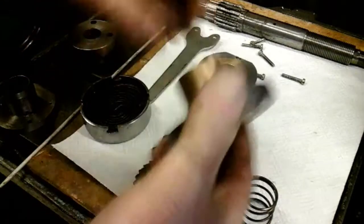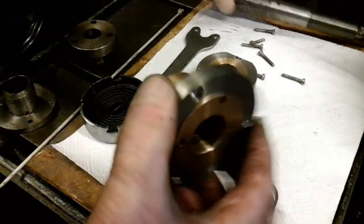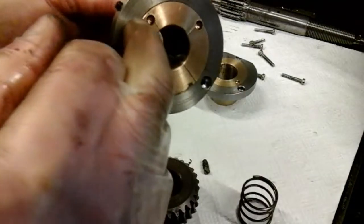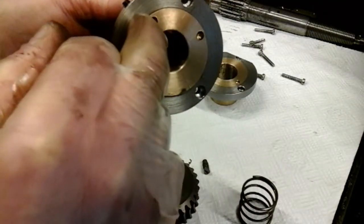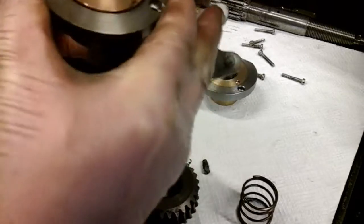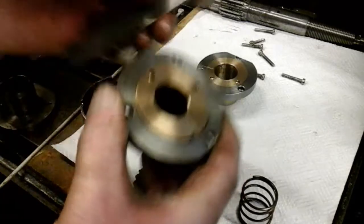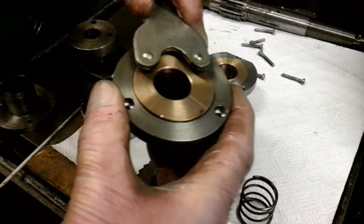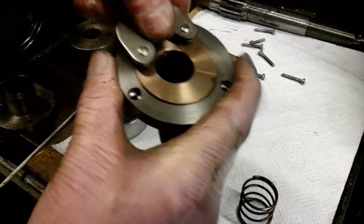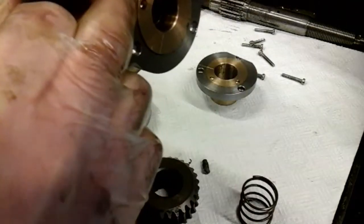When it's in the machine on the shaft, everything's a little bit on the tight side, so I've put two holes in. I've utilized my portable grinder tool - which I use for changing the grinding wheel - and adapted that to put a spanner in and adjust it when it's in the machine, to get fine adjustment on that offset, then put my grub screw in and peg it for proper adjustment.